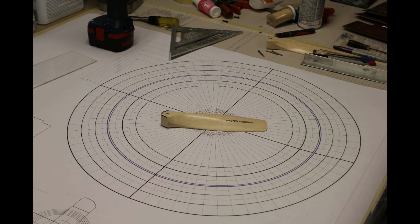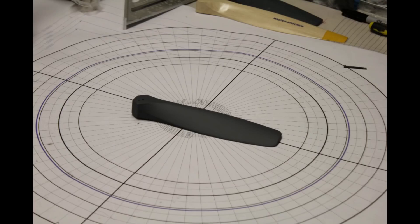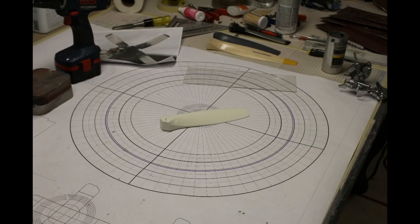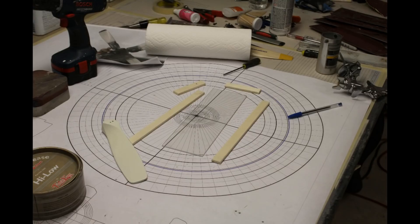This picture shows I've already started shaping the tip to look more like a C-130 blade. To take a master air screw prop and make it look like a C-130, it needs to be a big paddle-looking propeller, so most of the tip had to be removed. Here I've started sanding it down to prep it for primer because I don't want any wood grain — I want this to look like some kind of metal or composite prop. I then put a coat of white primer on it and very lightly wet sand it, preparing for at least five coats of clear enamel.